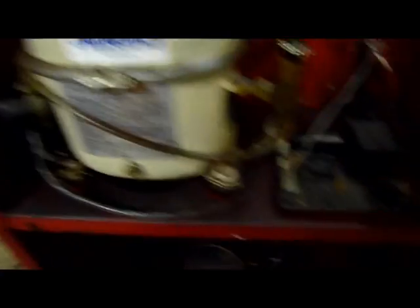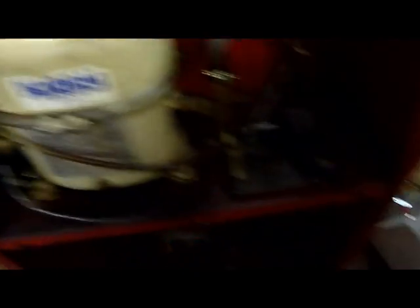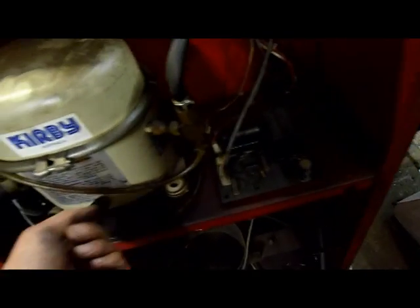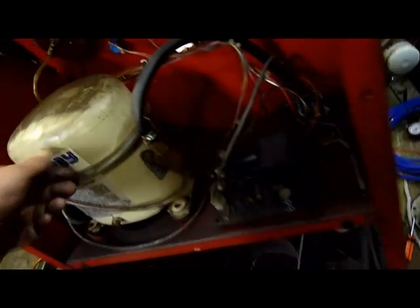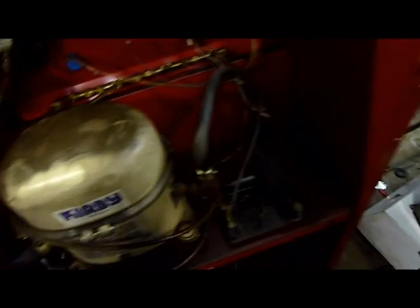I just realised something — the reason I'm not getting vacuum is because nothing's connected to it. The vacuum's down here. Something's missing — the tube tie stand-off with nothing attached to it. That's suction into the compressor. I'm guessing they haven't been using the vacuum pump for a long time. I'm guessing they just use it for charging and have a separate vacuum pump, so it's been butchered. Maybe there is a problem with the compressor — I don't know. I'll remove it from its enclosure, check the oil levels, and probably open it up.